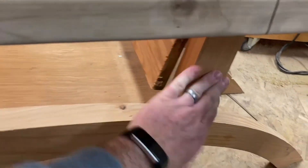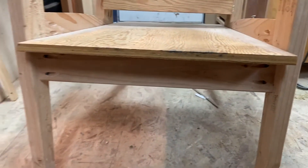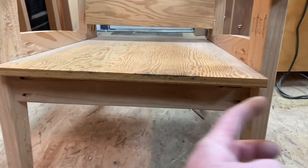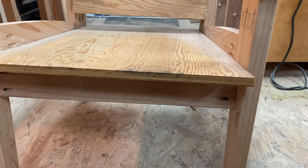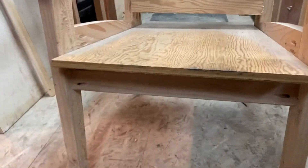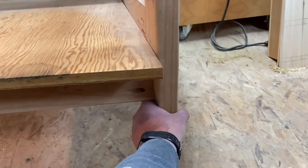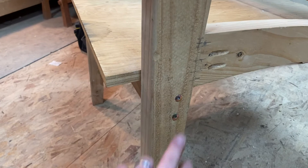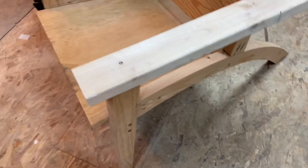A different process dealing with this front apron here underneath the seat. Pocket screws are an easy way to get this thing started once I've got it leveled — matching the height on both sides, measure and mark. Then landing some fasteners this way to really hold it into place. And there's no glue anywhere in this thing because I need to be able to make modifications.